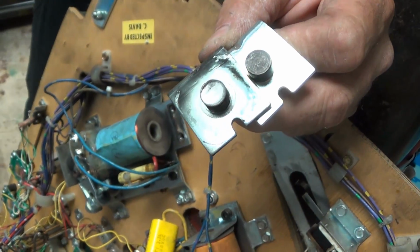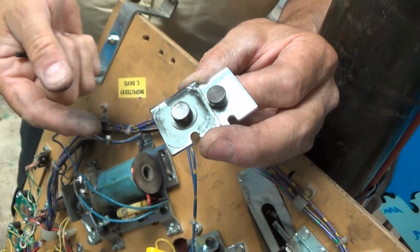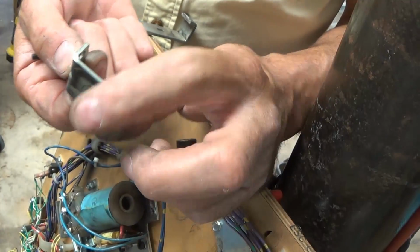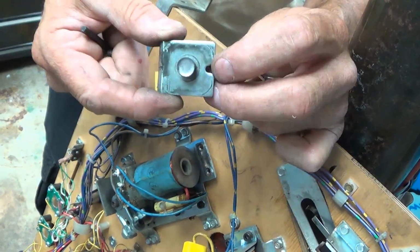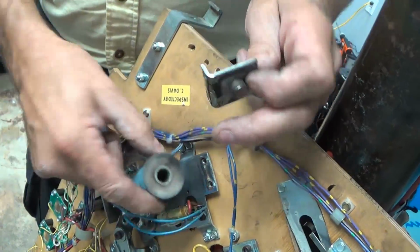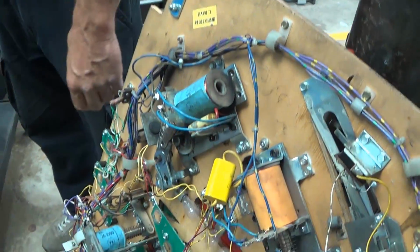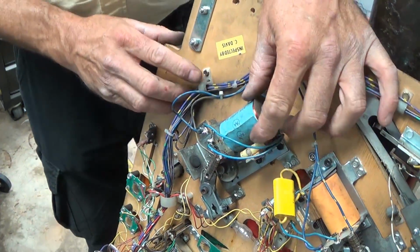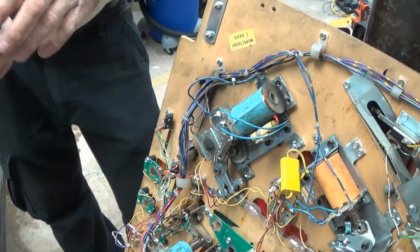And what's that cause? Well, it generally dumps dirt down in there, and it also causes the flipper to go too far. Oh yeah. If it goes over center, then it'll bind up, but if it keeps pounding that, it actually breaks the rivet on the other end. And it will also mushroom this metal out as it's hitting this. It makes it bigger, and sometimes they don't even come away from the sleeve. Yeah, they wedge themselves in there. Right. So, as a player, again, you walk up to a machine, you hit the flippers, and the left flipper goes up, you know, 1/4 of an inch, 3/8 of an inch beyond the right flipper. That's probably somebody replaced one end stop and not the other.